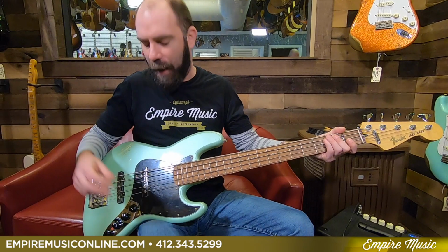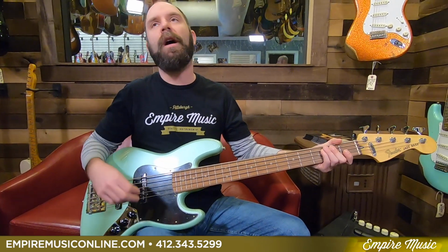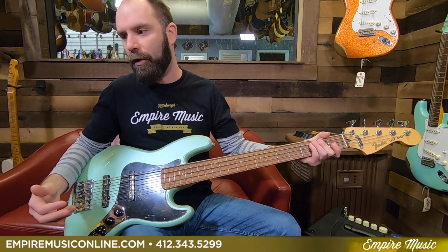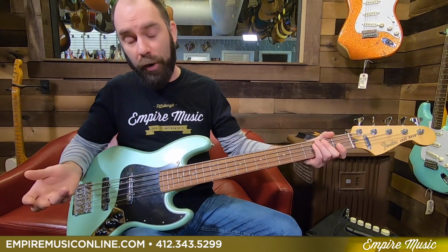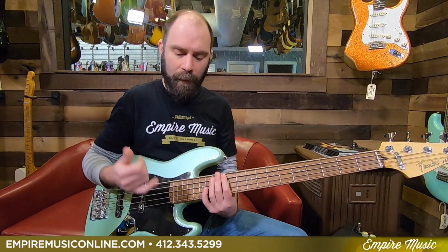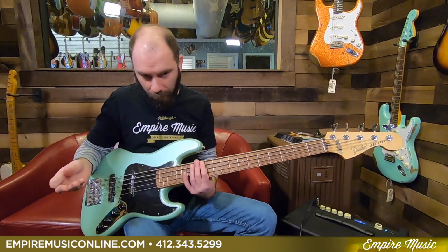So you'd put a 9-volt battery in the back of the bass. You'd have a volume knob. And rather than having the tone knob that I described on a passive bass, you had a 2-band and later a 3-band EQ that allowed you to boost or cut certain frequencies. Those frequencies would be bass, treble, and mid-range, or bass and treble at one point.